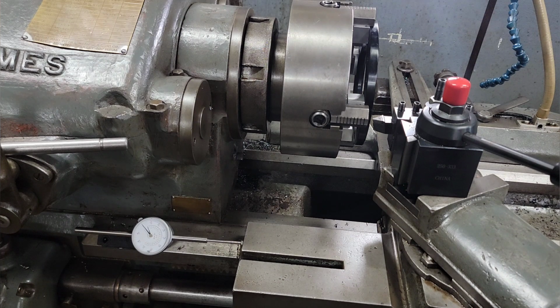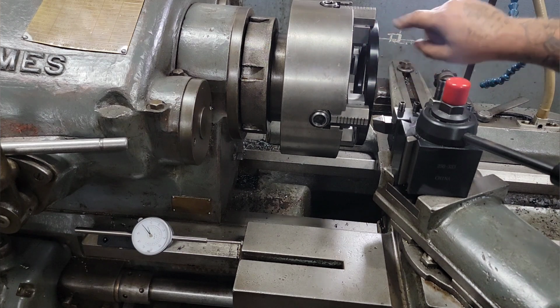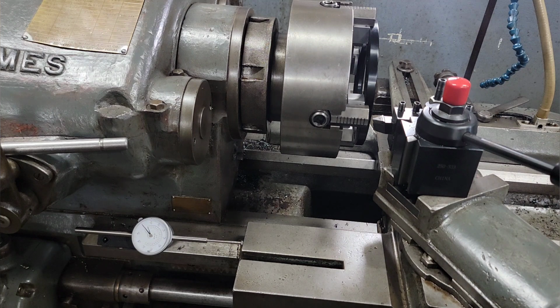They're a hair out. I think I showed that on the last video, but I managed to get it respectfully close. And it's within a half a thou as far as your diameter, because we're going to break these corners. I need to put chamfers on after we're done. And I'll use my dial indicator to determine how far I went in to make a certain chamfer so that I can repeat that. So I'm going to get moved out a little bit, get this tripod out of my way, and start machining the spacers. And just go through all four and then move over to the little radial.